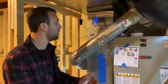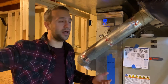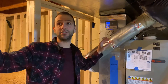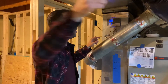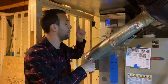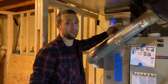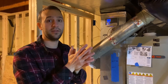If you don't find a break in the wire, your resistor outside might be bad — you can pick one up for about 10 bucks online. If replacing that still doesn't do it, you probably have a break somewhere else and should just run a new thermostat line from the outdoor unit all the way in to the prongs inside. I'll put more information in the description below. Hopefully this video was helpful — please subscribe, like, and comment!